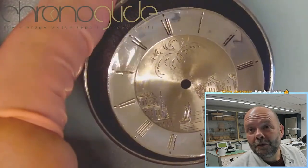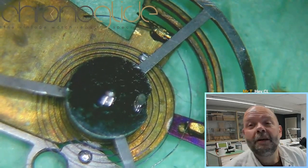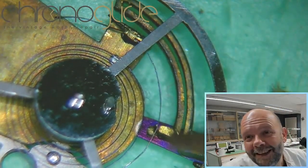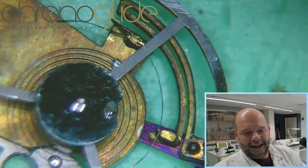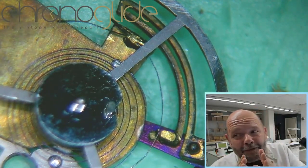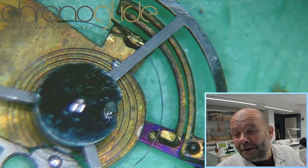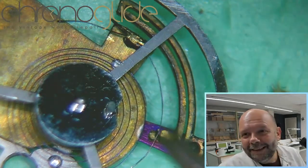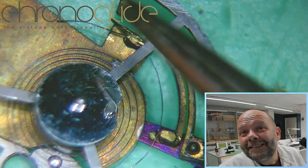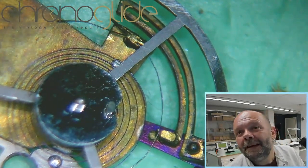The balance spring expands when it becomes warmer, making the watch run slow. Here we have temperature-compensated timing pins that go inwards; you may remember the timing pins through the pendulum make it run slightly faster. It is beautiful work — and we're in 2022 now. How would you make this in metal in one piece? I still wouldn't know, even with modern tools.